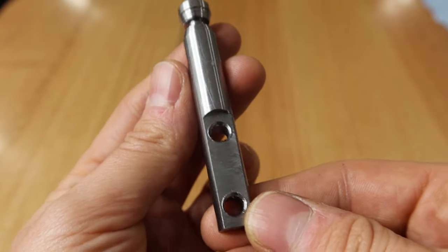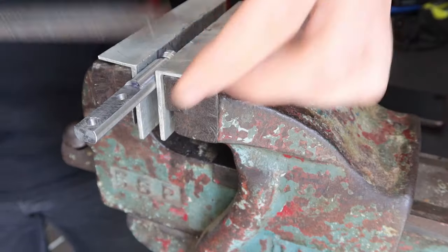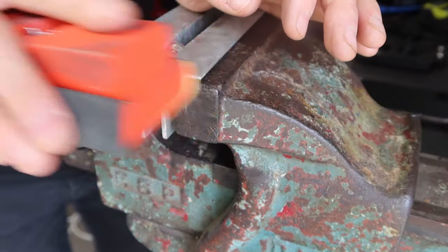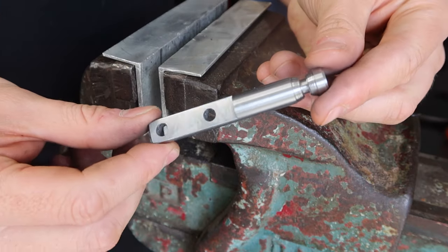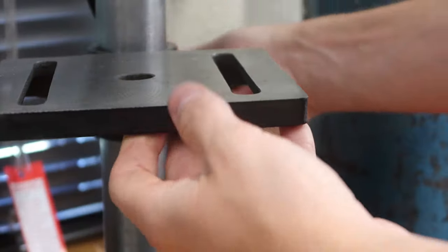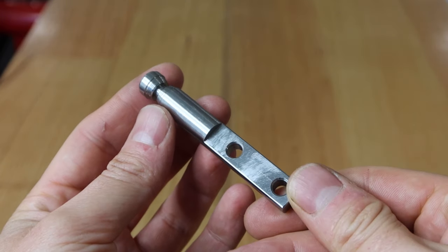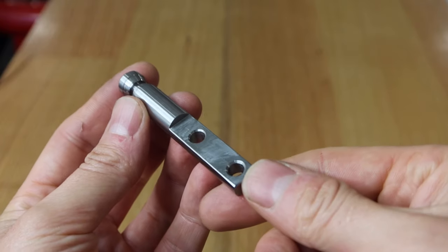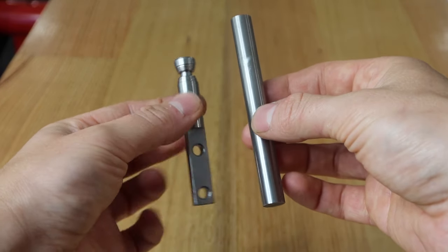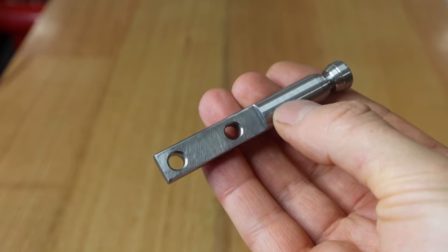You can see where I mutilated the hole before, but as I'd planned and kinda hoped, it will be removed once I enlarge the hole. I'm actually pretty happy with that - everything worked out more or less just how I planned it. There is a slight mark where the tool holder ate through the shim, but I've got a feeling it actually may not have been aligned properly, so probably my fault. That's actually starting to look like a part, but it needs some chamfers. And we are done - this is just how I imagined it. I left a radius to match the washer and nut on the bottom, and squared off the edge on the other side to meet the bottom of the 3D print. I could have filed the surface to be more smooth, but I actually don't mind the machining marks - I decided to leave a hint of them. I think it contrasts well with the smooth surfaces. I feel justified in keeping an ungodly amount of scrap around the shop now that I've made this little 100g part.